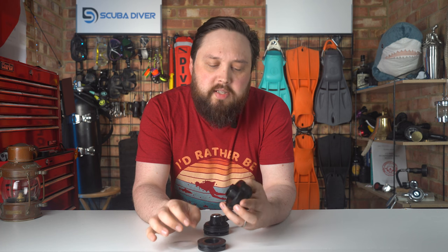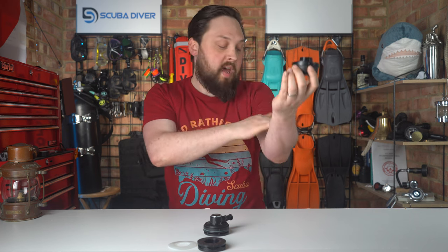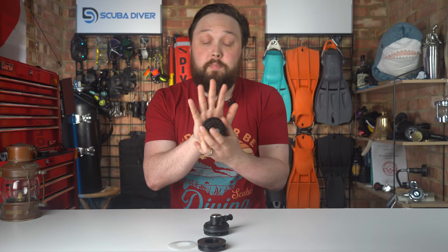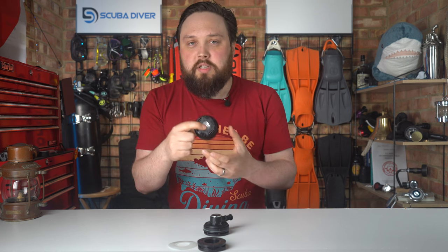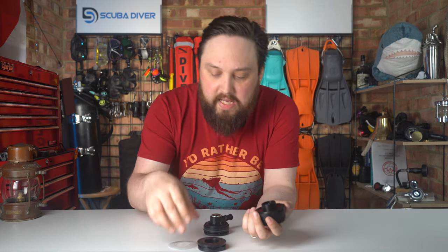It's quite good from time to time to take them out and give them a wash. I did hear a case — a commercial diver — who had a runaway ascent because he used a lot of talc to get into his suit. The talc you pour down the sleeve ends up around the auto dump, and when combined with water it created a paste that basically blocked his dump valve. So he went down, did his job adjusting buoyancy, but as he came up his shoulder dump wasn't venting — so he just had a runaway ascent. It's quite good to keep these nice and clean.